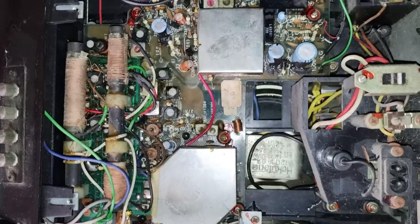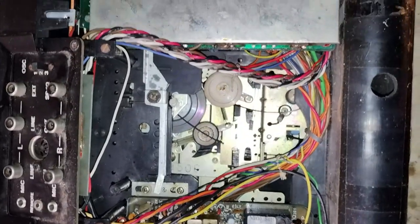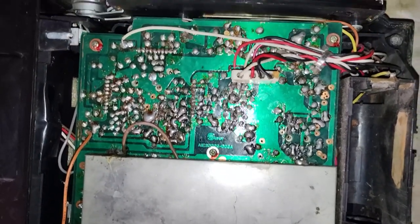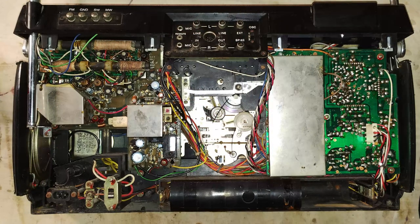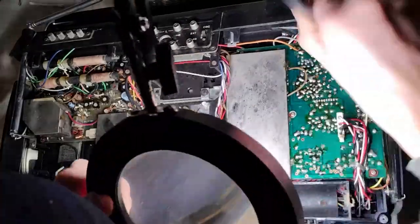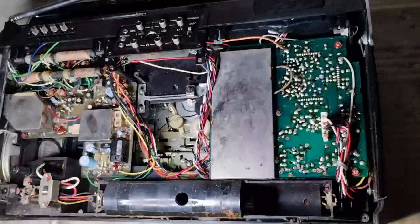The electrical arrangement inside this set is intimidating, due to the amount of wires directly soldered between the various boards. At the moment, only the loudspeakers seem to have a removable connector. Before thinking of powering on this set, one should pay attention to the input voltage selector and on the fuse. Whenever anything becomes accessible, it is a good idea to clean for what is possible, always paying attention to all the delicate parts, especially the thinner wires.